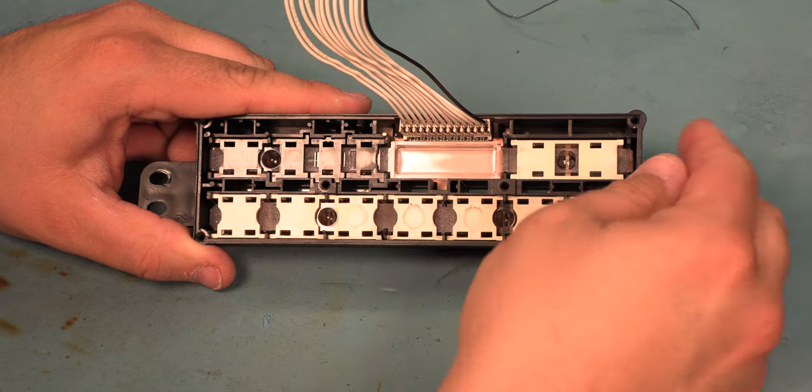The kit comes with this 3D printed spacer from batty.com. We designed this as a way of keeping the factory screws at the top wiring harness connector from pulling the main logic board away from the faceplate the way this was when we opened it up. So we're going to install that spacer. We'll place it over the wiring harness connector.